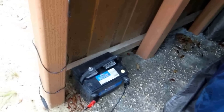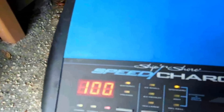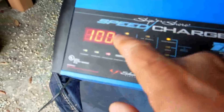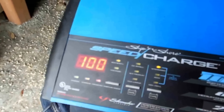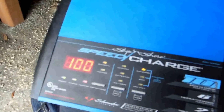This thing keeps a nice charge without overcharging, thanks to that little panel — you don't need a charge controller because it's not that powerful, but it's strong enough to keep it at 100%. I didn't think it would keep it at a hundred percent. I have one that's just a little bit smaller and every couple of months I have to put a charge on it — it goes down to about 75%. But this 12-inch by 4-inch panel keeps it up just perfect.